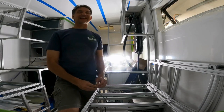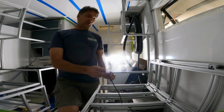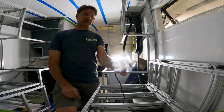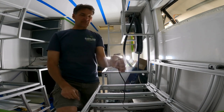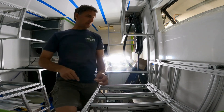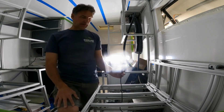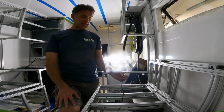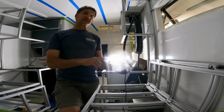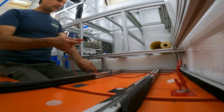It's an exciting time — I'm getting ready to test out the first linear actuator in this camper. There are over a dozen planned. Unfortunately this one has a proprietary connector, so I'm just going to hook it up to a switch directly. I'll cut the connector off and hook it up to my batteries right here, hold it away from the bench while I actuate it. I need to confirm my positive and negative, then test for the full stop so I can verify the bracket cut and drilled holes are right, and replicate the same for the other side.